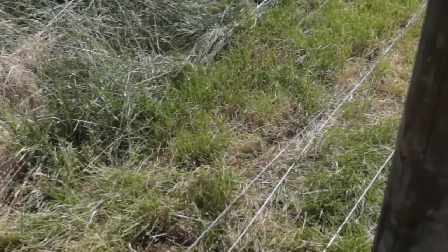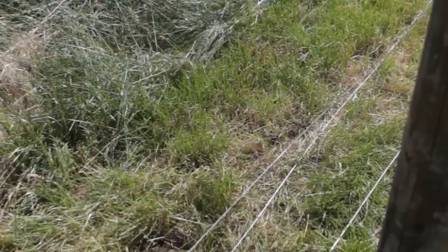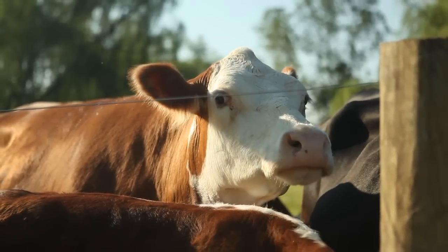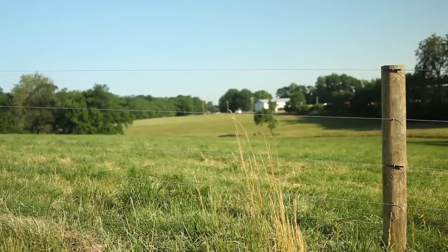The bottom wire is the guide wire. Next to the guide wire are the next two wires, which were previously laid out and will be the first to be attached. Any wire on your fence can easily be electrified, making the fence a psychological barrier as well as a physical one. One electrified wire should be positioned at the animal's nose height, causing it to back up if it touches the fence wire.